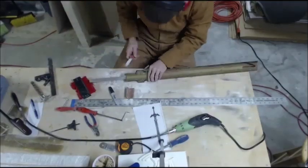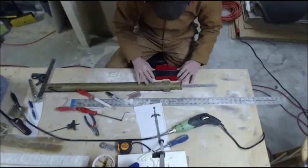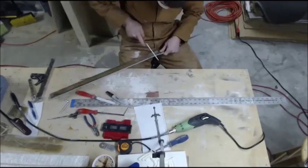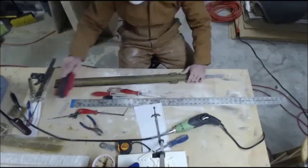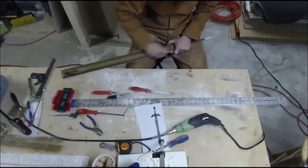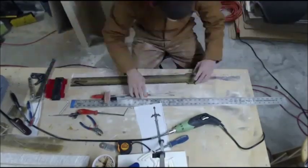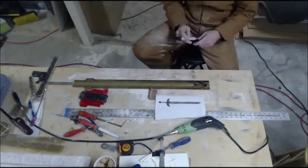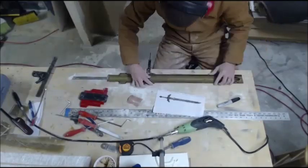A little device you see me using there is called a contour gauge. It lets you press it down on one side of the object and it makes an exact copy of it. There are versions such as I have which are just red plastic pins. They make some that are a finer contour. I picked mine up at Harbor Freight for about five bucks. Infinitely usable when it comes to doing this sort of thing — you can use it to instantly replicate any curve or shape that you need. In this case it was truly invaluable.